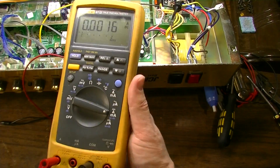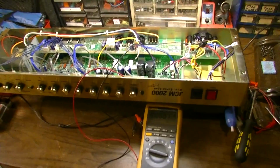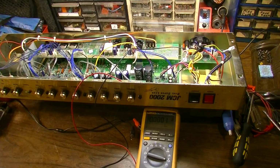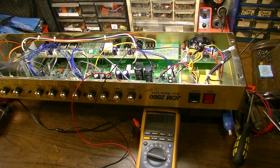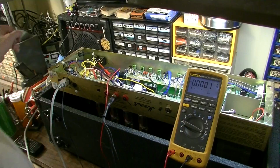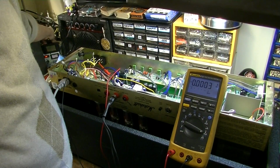So here are amps and milliamps, and what we want to do is measure the current that's going through that circuit, but also through that fuse. So this will tell us whether or not that fuse is about to blow. And we'll dial this thing up on the variac slowly so that we're sure we don't overload anything.